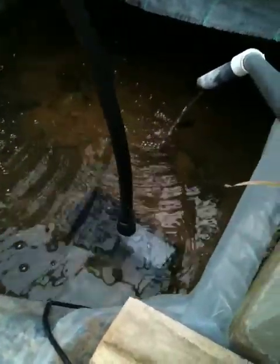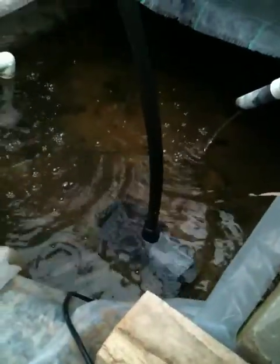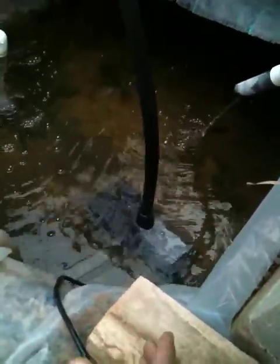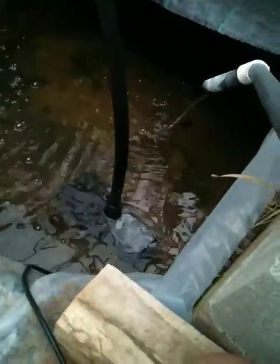The other thing I did was the other two pumps were hooked up in parallel to the distribution system. They both had quick connectors on them, and they had check valves on them. I got rid of all that — the check valves, which are kind of pointless when you have just one pump, and the quick connectors. The quick connect is very good for easy access to the pump, but it does slow your water down.